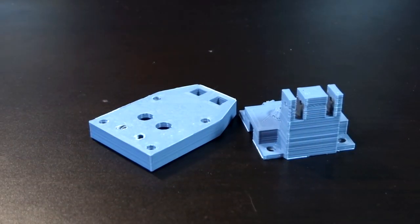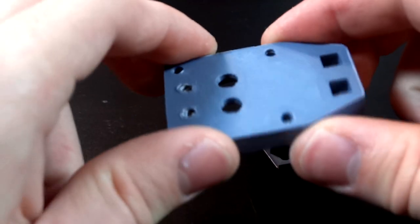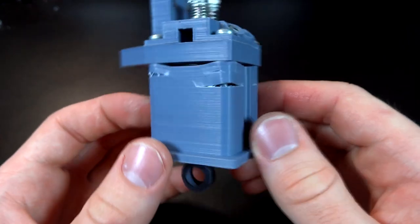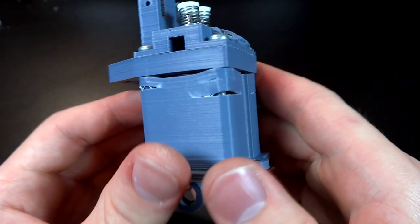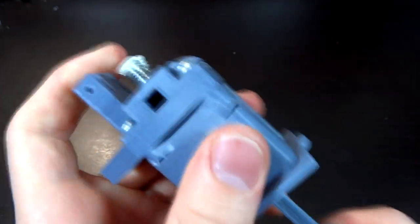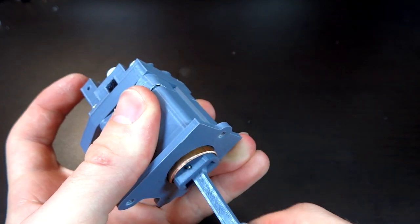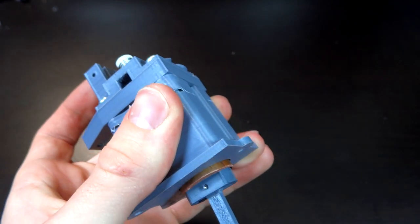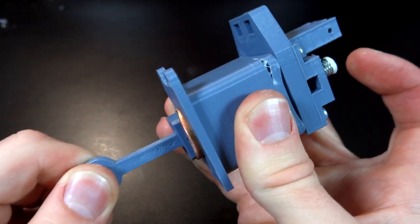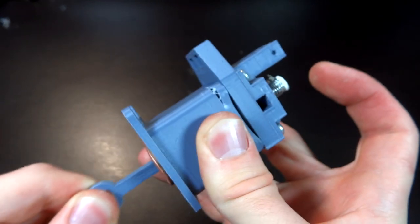It's also worth mentioning I've designed a new head made in two different pieces, so it's a lot easier to assemble because you don't have to worry about the supports. As you can see, the cylinder housing is absolutely finished with all this testing. I think if I actually pull the head off, it won't go back on — so we kind of got one shot to test this out. You can see when I push on the valve as I'm compressing it, all of the air shoots out at once. I can see there is a little bit of a leak, but it isn't actually that bad. It's probably good enough that this could work. The compression seems like it's more than adequate for what I need.